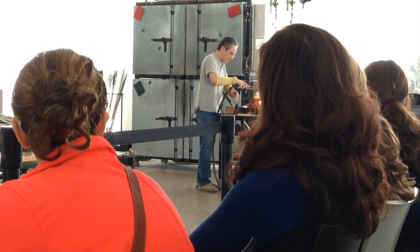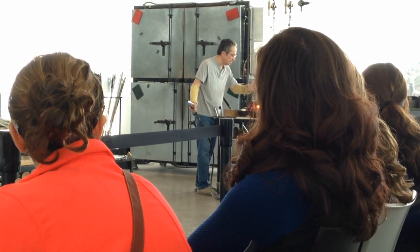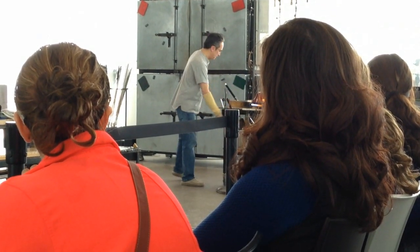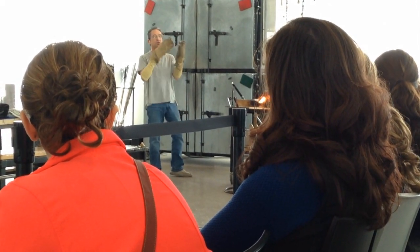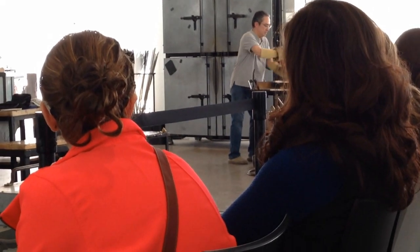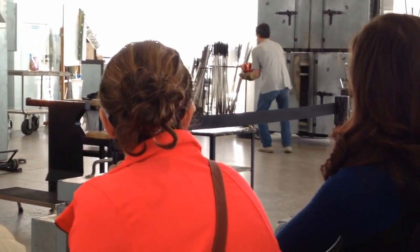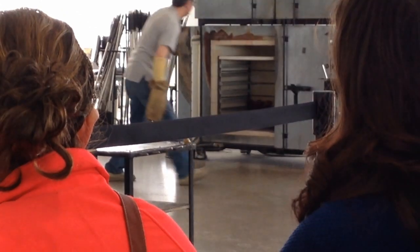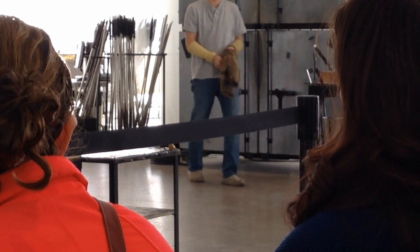Once that glass is hot and molten enough right there at the base, I have a little stamp. I'll press it here. This will identify it as a museum demo piece. So forever, everybody will know that this is made at the museum. Meanwhile, it's still over 1,000 degrees, so I have to wear these heavily padded gloves that are made out of Kevlar. A copper ruby red bowl, red grit. Oh, that's hot in there. And in the annealing oven, everyone, it will stay for about the next 18 hours.